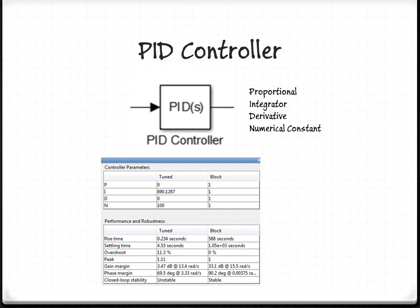Our system needed to get a rise time of less than 0.6 seconds and have an overshoot of no more than 15%. This allows the golf club to hit the ball at a range of speeds which would be deemed appropriate for a skilled golfer. Our project needed to decrease its rise time, but with an oscillation around the desired output. Therefore, we decided to go with the integrator term instead of a proportional term.